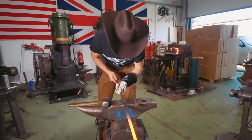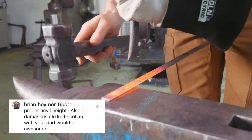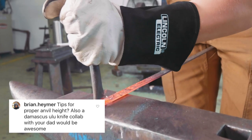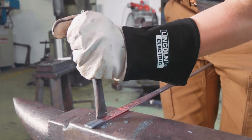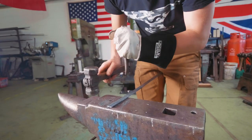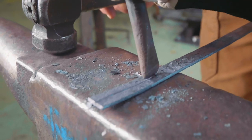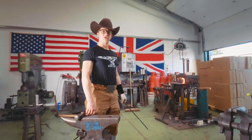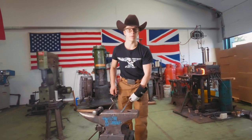While I start laying out my chisel lines for the tines, Brian Hamer has asked — we're doing a little bit of a question and answer in today's video — Brian Hamer has asked: do I have any tips on establishing and judging proper anvil height? In fact, I do. The best tip I can give is this: when you're doing general work at your anvil, you want to be able to put the piece of steel between your legs. You don't want the anvil to be too high that you can't do that. A pretty good measure of the right height is when you stand up straight and your knuckles are just dragging across the anvil, and you can still fit the piece between your legs.